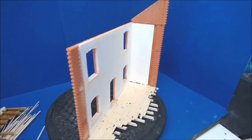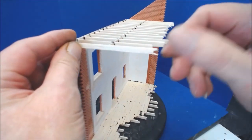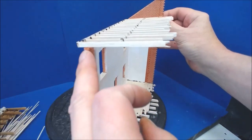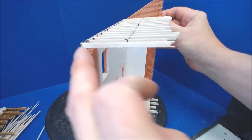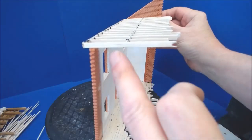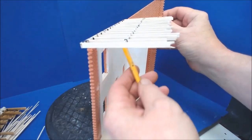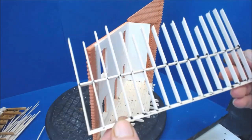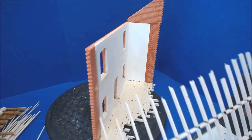Now, when we made this, we made it slightly bigger, because when I get my big hands out of the way, I'll try and hold it that end. Made it bigger to give an overhang, so when we actually come to fixing all this, we can actually cut this piece off. Now, what you do is you give it an overhang, get your pencil, run along the underside and get a mark. And now we're going to take this down to the bench. We've got the mark on the underside. We're going to take this down, and that is where we're going to position our first lath.